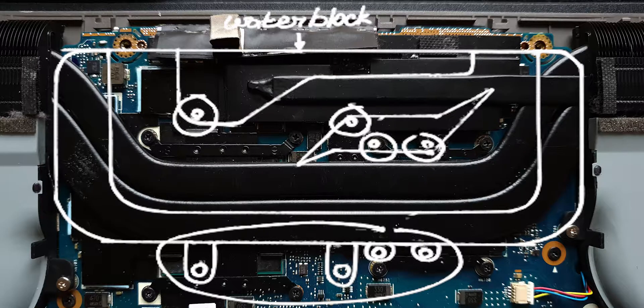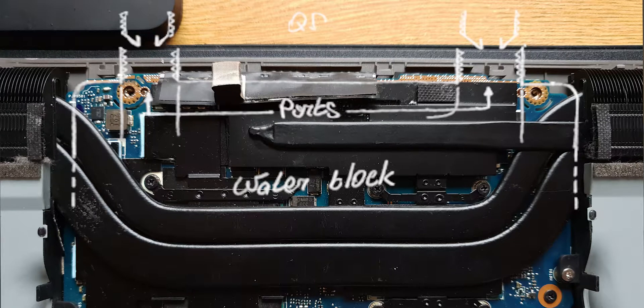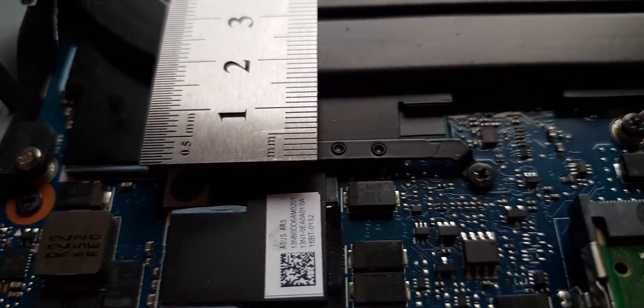There will be four holes within the water block itself for the top four screw holes, and extensions down from the water block for the other four holes. The estimated width of the water block is 68mm — estimated because we have to add the extensions as well as the ports. I'll be putting threads through the ports and using them to attach the QDCs. The required port length is 20mm and the extensions are 15mm, giving a total width of 100mm.